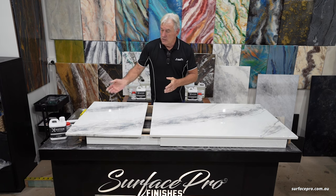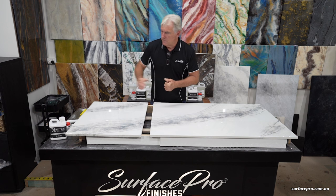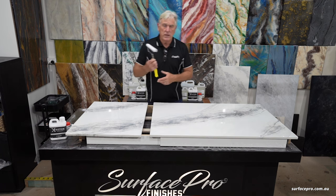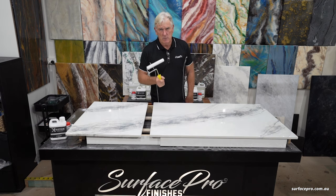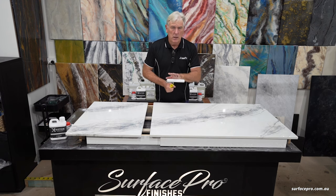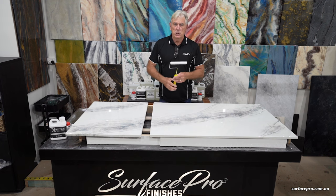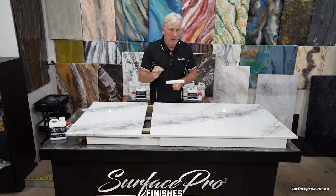Now, I'm using, and we recommend and use, 4mm nap rollers. Okay, you can get a whole range of sizes on the market from various hardware stores. Do not get a 10mm nap roller. Do not use a sponge roller. If you want to achieve the results that you want to achieve, use a 4mm nap roller.